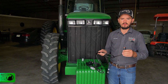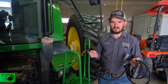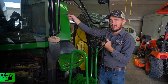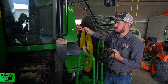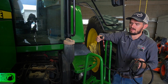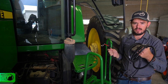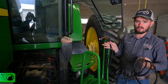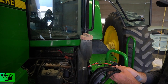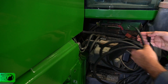For installing these cables, we first find a way to route the power harness from inside the cab all the way to the battery box. If the tractor does not have a hole in the floor, we'll need to make one — big enough for both the power harness cables and the angle sensor cable. Once the hole is ready, we introduce the cables, route them through the cab to the battery box, and connect the positive and negative to the battery and tighten them up.